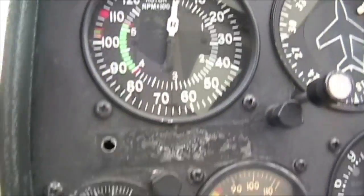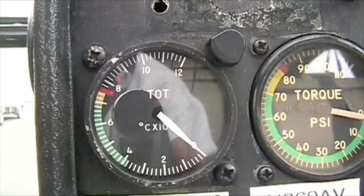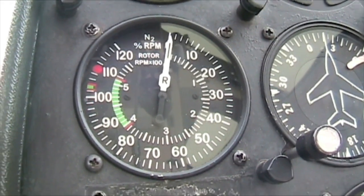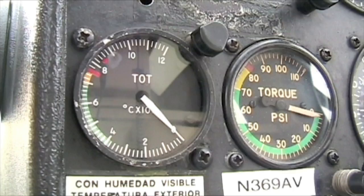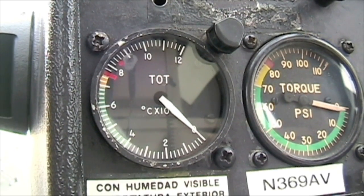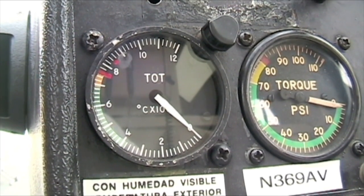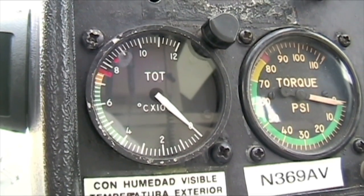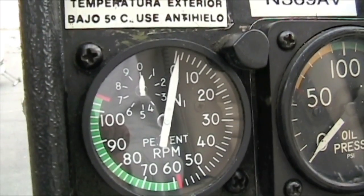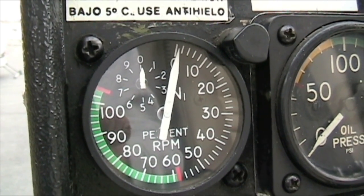Cool down, spool down, needles have split. Watch your TOT for a temperature spike — temperature should continue to decrease. You should continue to spool down on your gas producer, and the needles should continuously decrease on your tachs. If there is a temperature spike in your exhaust outlet temperature, that's from the accidental introduction of fuel. In that case, keep the fuel turned off but press the starter button — it sucks in nice clean cool air and gets the heat out of the turbine. Once your TOT is below 150 degrees and your N1 is at zero, you're done. This thing will not light back up because your gas producer is not producing.